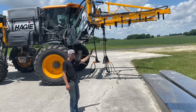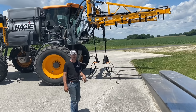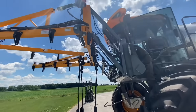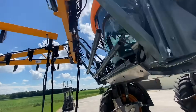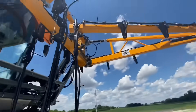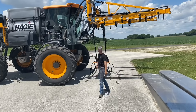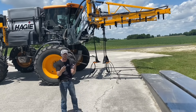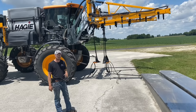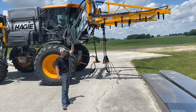It's front-fold, as you can see. It's lightweight — that machine doesn't even know that thing's sticking out there at 60 feet. And we can customize this thing: we can do 30-inch drops, 20-inch. We can do the 360 glide — you saw me do a video of that the other day. This thing is fully customizable. We bolt the breakaways directly to it, so that your breakaways fasten directly to our bar. We do a five-section liquid plumbing across that 60-foot bar.